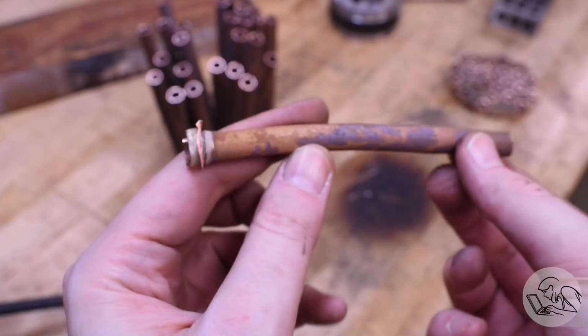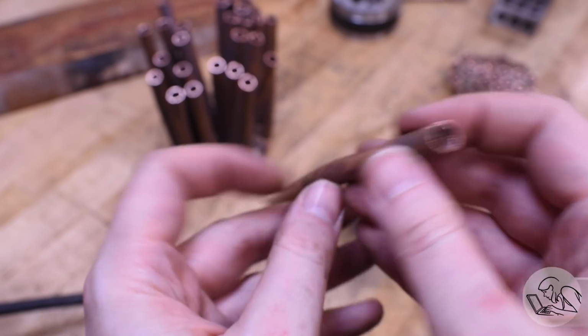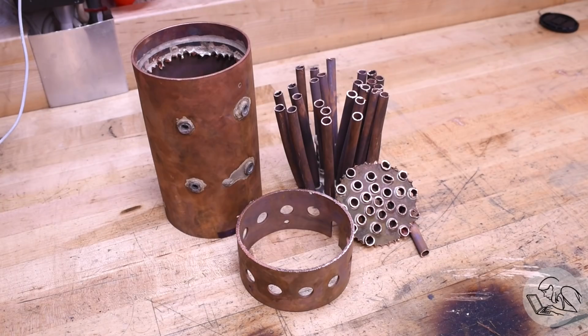All the repair efforts and deconstruction have left basically all the components badly distorted, as you can see on many axes. So nothing except the firebox is going to get reused in the next boiler, but none of this copper will go to waste. It'll all be useful for something. It'll go in the stockpile. The old shell is too out of round to reuse. What I will probably do is split it lengthwise and anneal it and unroll it and make a nice big piece of copper plate out of it, which will be very useful for future projects.